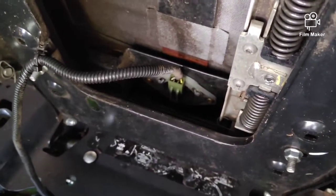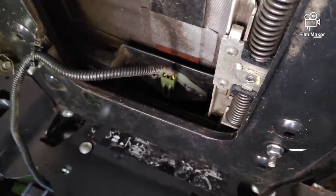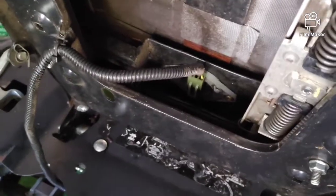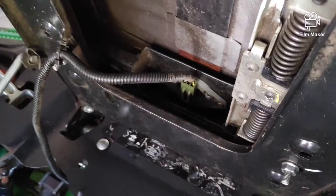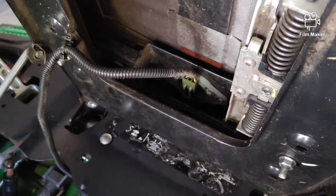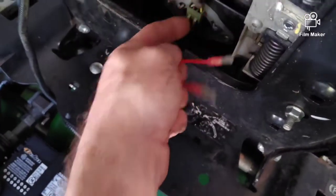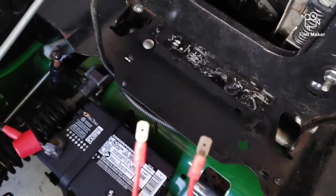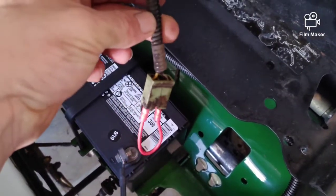These units also have a safety switch on the seat located right here. If you're not sitting on it, it won't run. If it's running and the parking brake isn't up and you sit off the seat, it'll stop — that's normal. But sometimes this might cause problems with it not wanting to continue to run, or if you're cutting and bouncing on the seat it'll cut off and people think something's wrong. One way to check or temporarily solve the problem: take that harness out and make yourself a jumper wire. We would often do this just to help diagnose a problem.